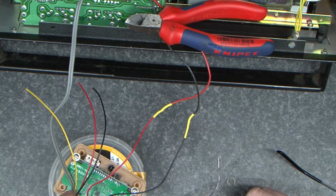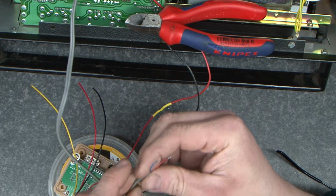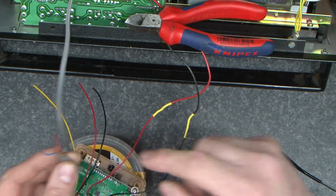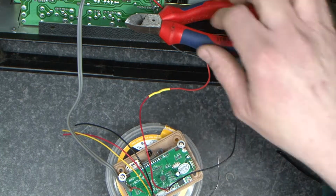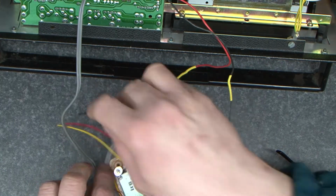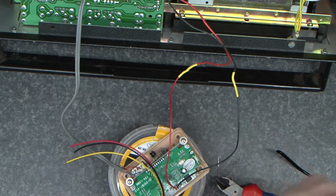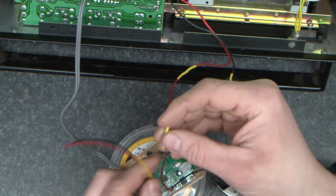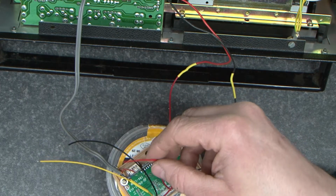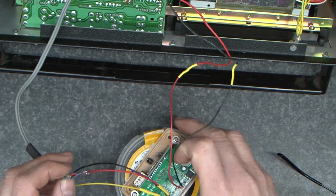So I'm looking at this, which is the signal path. We've got two nice small ones here, and I think I'm going to have to put a larger piece of heat shrink over it all to tidy up and keep the ground nice and safe. So let's do the two channels first, and then no, because if I solder the two channels on and then I want to put a bigger piece of heat shrink over there, I can't. It's going to have to go over the cable first. So I'm going to drop on my heat shrink for my channels, and then I'm going to grab a larger piece of heat shrink sleeving in a moment. Okay, there we go. Just put a bigger piece of heat shrink over there.